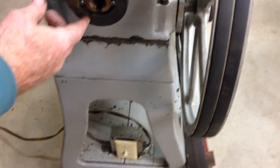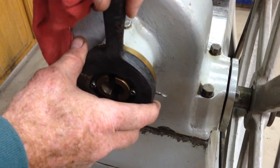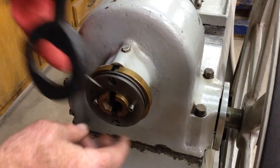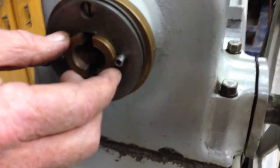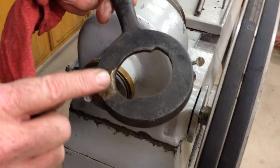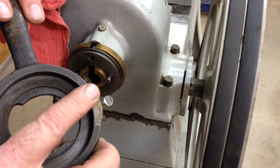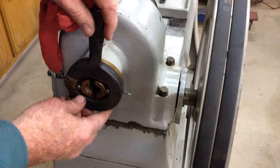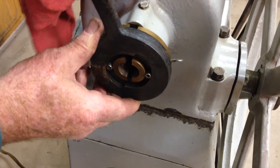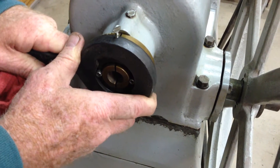There's no cracks, it's not broken. It's never been outside in the rain — there's no rust. Now here's where the lead screw goes through, and you can see this is the binder that brings the bronze piece down on the lead screw. This has obviously been broken at one time in its life, but it's been very well repaired. You put this on, you can see it operate and it'll pull these guys right in.